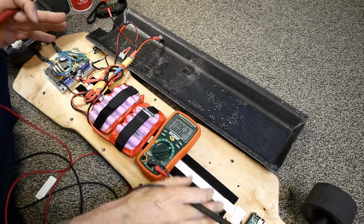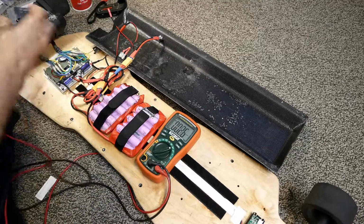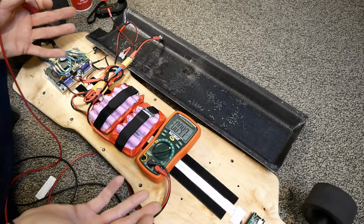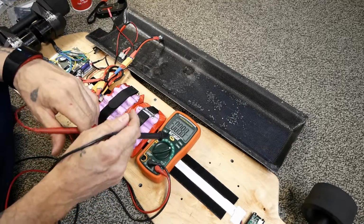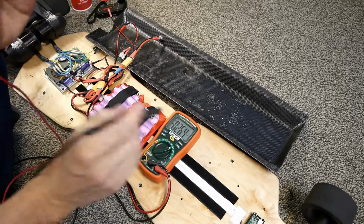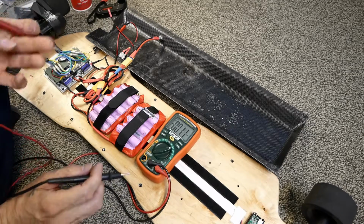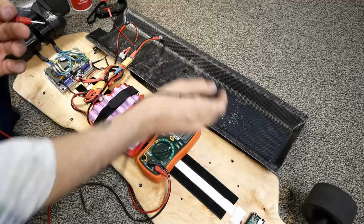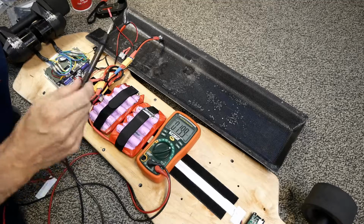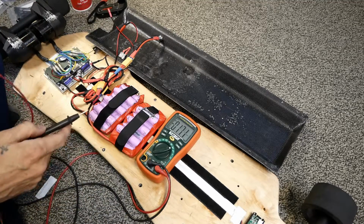under the top and bottom right down here, there are multiple sheets of full carbon fiber. There's another strip of carbon fiber. There's some fiberglass in there as well, 22 ounces, same stuff I do on the snowboards that I make. So it's a really good construction, but the point here is that yes, there is carbon fiber in this board. So that's somehow got to be the problem. We just saw it's conductive, but where is it getting the hot from here? Well, let's first check that. Is it really the carbon?